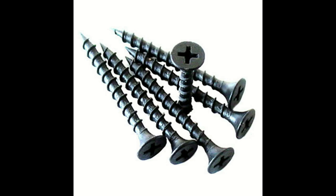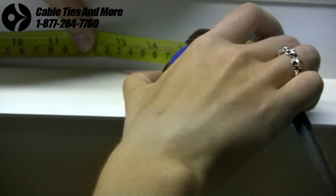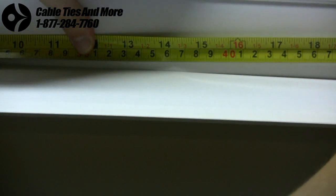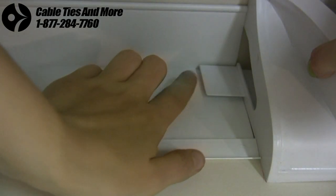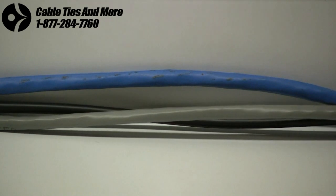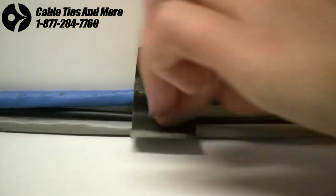Next, to secure it, you're going to use one-inch to one-and-a-quarter-inch coarse drywall screws, placed about 18 inches apart. Drill them in at a roughly 45-degree angle, working from one end of the length to the other. The corner pieces will take those same types of screws, and you will drill directly through these mounting tabs into the base below. Next come the wires themselves. Take all of those cords from your entertainment systems and other pieces of technology, and secure them to the base using some tape, just so that they don't interfere with the rest of the steps.